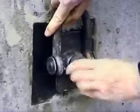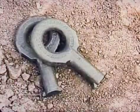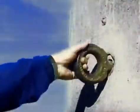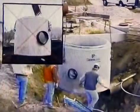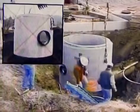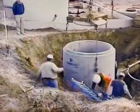Attach D-rings with the appropriate size bolt and tighten. A similar lifting method involves a key-type lifting device — simply insert the key and turn to lock into position. Attach lifting cables from vertical sections to a spreader bar and set into position. Do not use center-pick slings for handling vertical sections, as this method will damage the spigot's rim, resulting in loss of gasket seal when the pieces are connected.